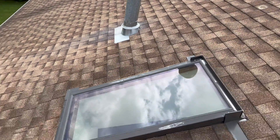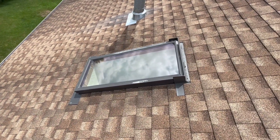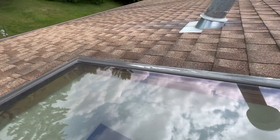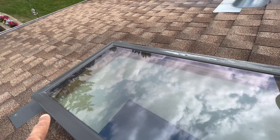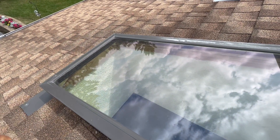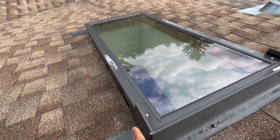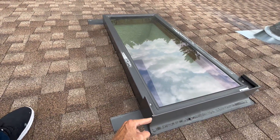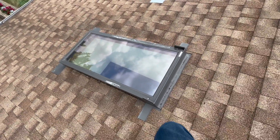The last thing we've got here is a skylight. This is a fixed skylight so it's non-venting. You'll have to check your skylight and see if they vent or not. This one's got a natural interior on it currently — nowadays they ship them all standard with white interior, which looks like it would work pretty good because it's matching right up to a white ceiling. So when we order this roof, we'll probably order a white fixed skylight. You always want to measure the frame size — measure the outside of the frame from here to here for the width, and then measure the height. This one's 22 by 47 and a half — it's a pretty standard size for Velux.